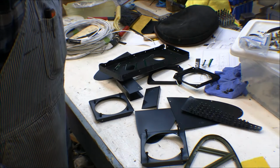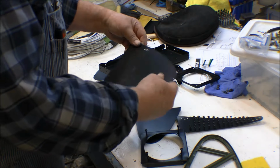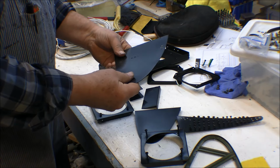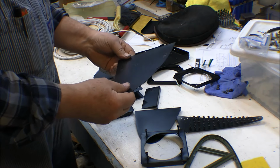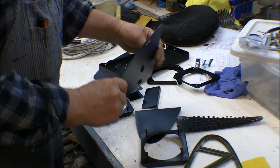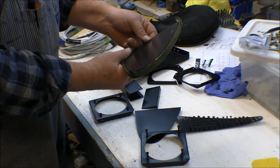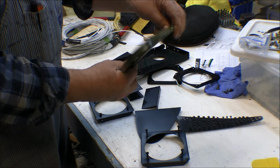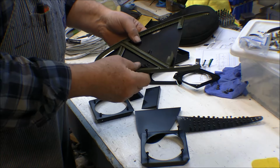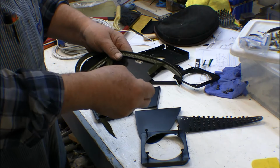Well, I can start putting that together. And checking it, I should have done that before, but I didn't. But checking this piece goes up against one of the ribs, like this, only the fixed rib. And when I got to checking it, I noticed that one of the nut plates that I put on there interfered with the rib.